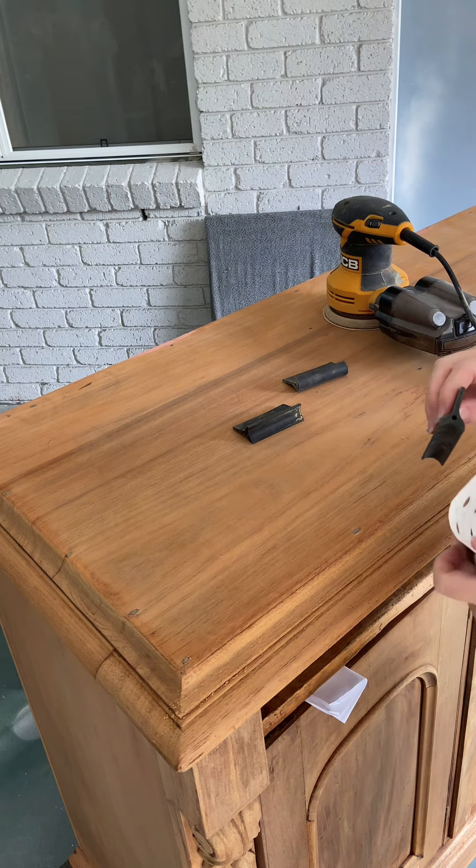The wood bleaching process was actually really easy and way less scary than it sounds. To start with, I mix the A and B parts together in this trigger bottle as per the instructions. Don't leave the product in the bottle unless you want it to potentially boil over — the chemical reaction causes it to heat up so the oxygen it creates needs to escape somewhere.